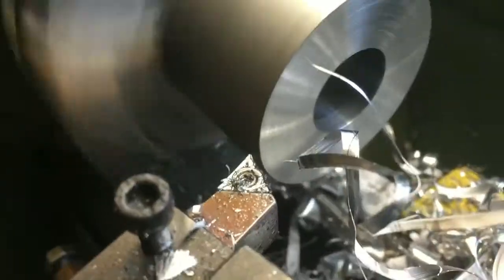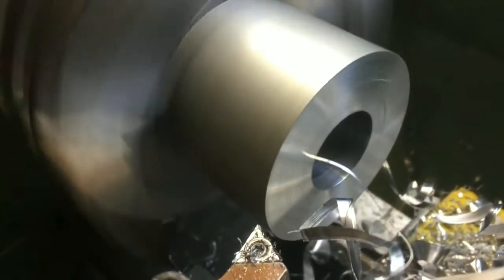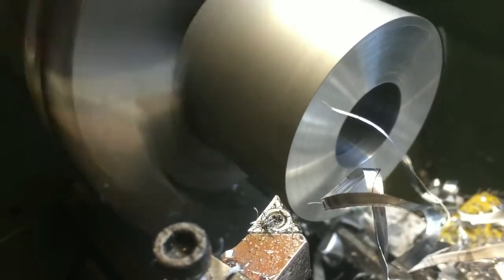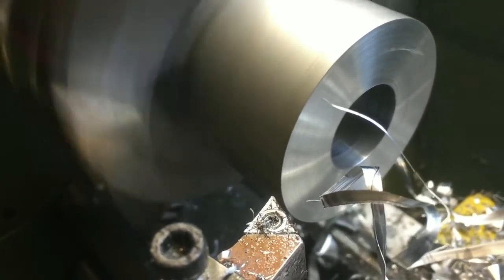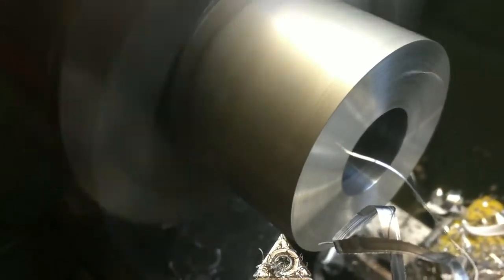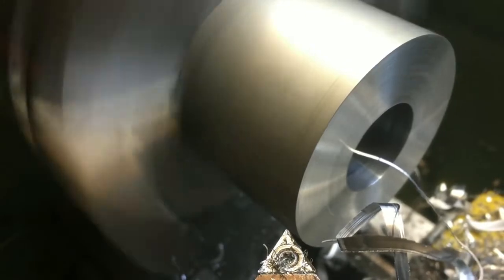I'll give it a clean. And that's a 21mm drill, right through, one go, no centre drilling, no nothing, running true-ish — but we've got plenty of meat left in there for me to clear it out when I put the boring bar up to the 23mm finish diameter. So having already done one, that's two — three to go. That's step one.